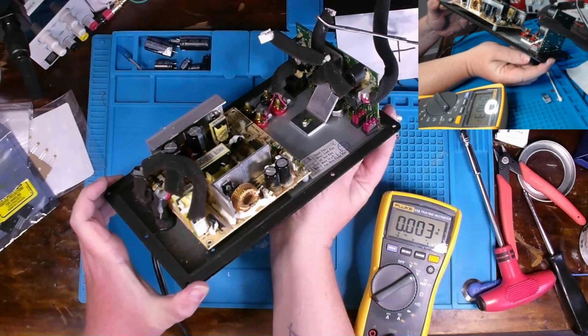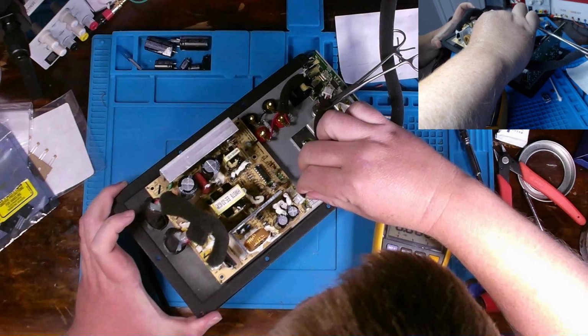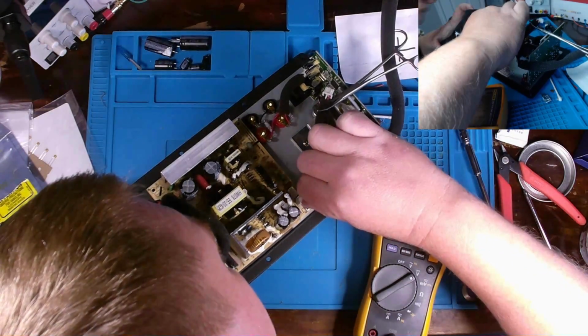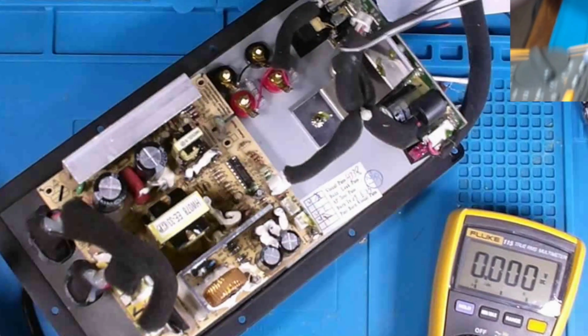So let me turn this off. Plug in this. Okay, let's not make that mistake again. Of course, you need to let the high voltage side discharge before connecting anything over on the other side, unless you provide a path for current to flow.